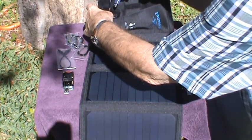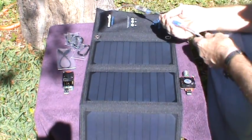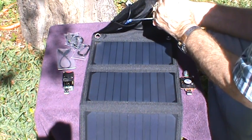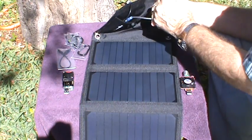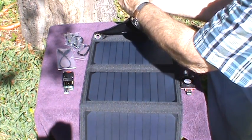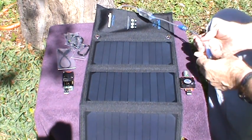I'm going to be struggling a little bit because the bright sun makes it hard to read these, so I'm going to have to shade them. Right now I have no load, and on this side I'm getting 5.2 volts, and on this tester I'm getting 5.15 volts — no load. Now I'm going to stick a load on here.